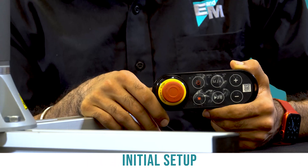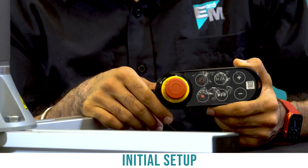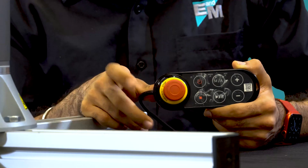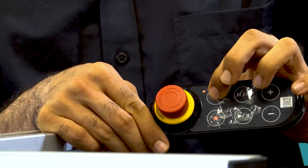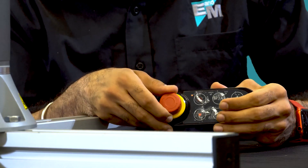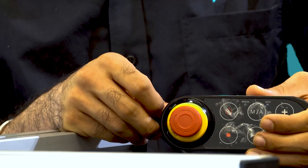Please make sure you have the emergency stop pressed in when turning on the robot, since it is in packaging posture and we want to turn it on in safety mode. Once the stop is pressed, press the power button for two seconds and release it. You will see the red light turn on — the flashing red light signifies that the robot is initializing. Release the e-stop button and you will see three lights flashing on the robot stick.